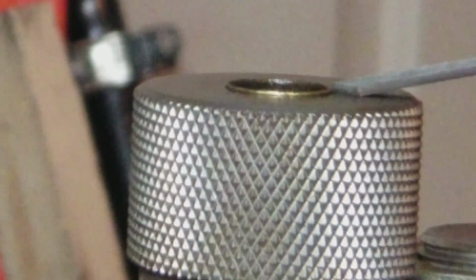Okay, take a look at this. So push the file in there, we can see, you can visually see how much material there is on the top. So the way a trim die works is this. Now depending on what you're doing and what trim die, because there's trim dies for many other cases. Sometimes you'll have about this much sticking out. You just take a hacksaw over the top and then take your file and polish it off.